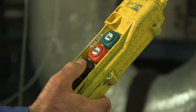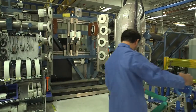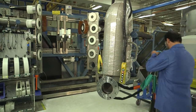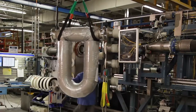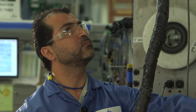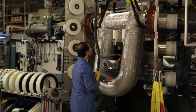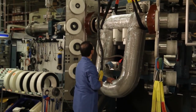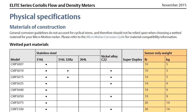Heavy meters over 50 pounds, and even lighter meters that must be installed in elevated or difficult to reach places, usually require additional consideration when transporting or lifting them into their installation location. Safe handling during transportation and installation is the responsibility of the installer. Know and follow all safety practices and regulations for your facility for lifting and rigging equipment being used. Lifting should be performed by qualified personnel. The weight for each sensor can be found in the sensor product data sheet.